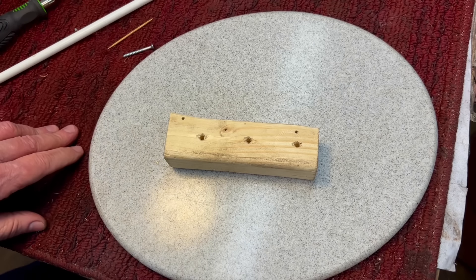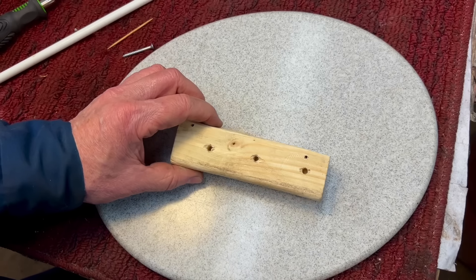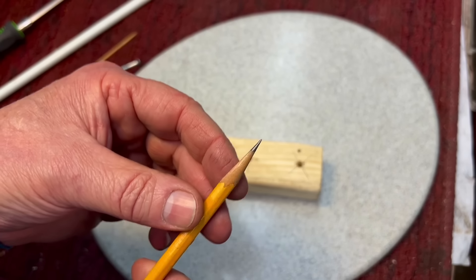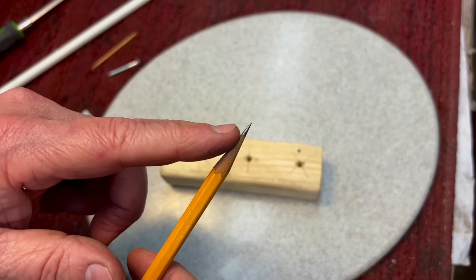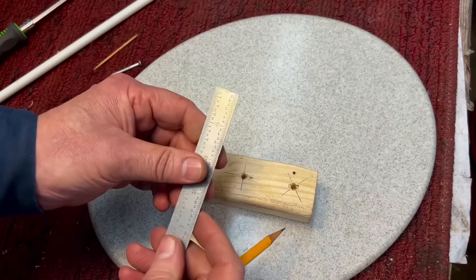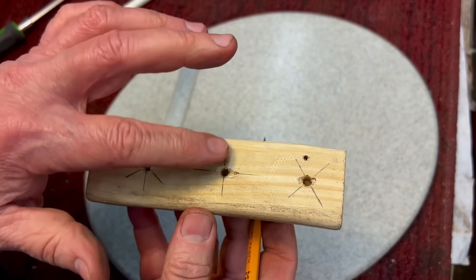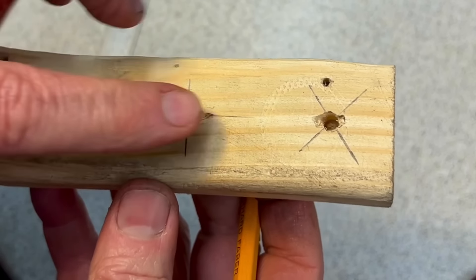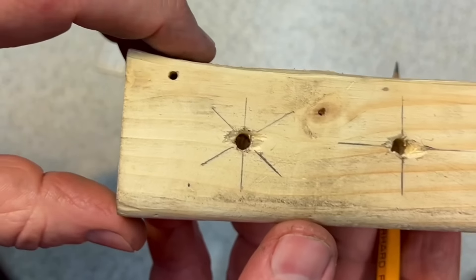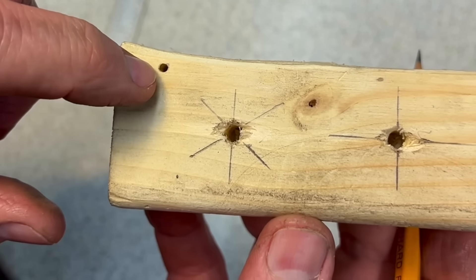Before we get to that, the first thing we're going to do is put a line directly over the center of these holes with a sharp pencil and a rule. This is one of the few times a sharp pencil comes in really handy in the shop — otherwise the point is too fragile and will break. We want that line centered over each hole. It doesn't matter what orientation these lines are in, as long as they go out about a half inch from the center of the hole. You can see I have an X over here, a cross over here, another type of X — but the one thing is they all center in the middle. That's important — remember that.